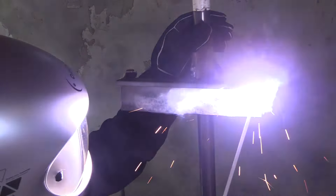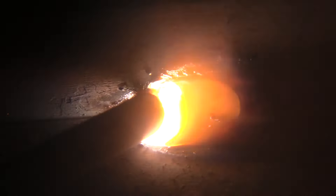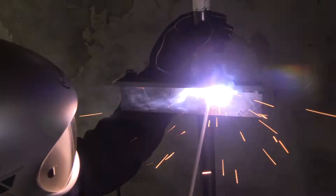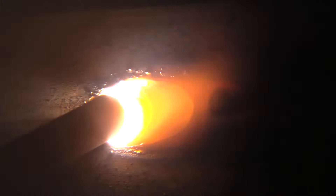I'm using a little bit of a drag angle — nothing too steep. You'll see me at times use more of a straight-in angle, and that's probably accidental. But angle is very forgiving as long as you hold a really tight arc. You can see the edges of that flux are actually kind of touching the edges of the metal. I can feel the flux scrubbing a little on the base metal — I'm not trying to jam it in there, just trying to keep a really tight arc.